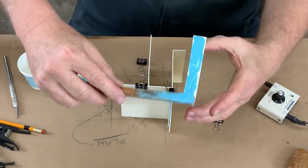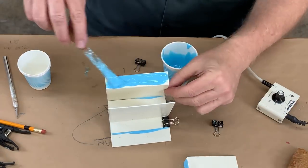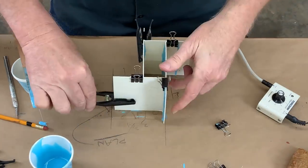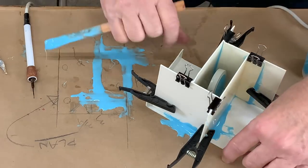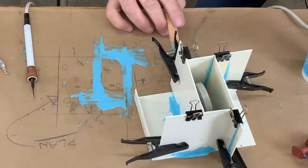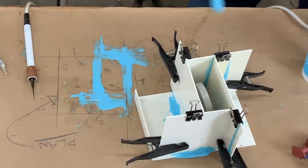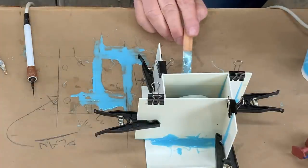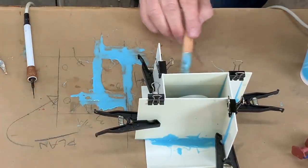Let's put this case together and we're going to glue it together with the same rubber that we cast it with, so everything will be nice and compatible. By using rubber like this as a sealant, you know the mold's going to come apart well, everything's going to be compatible, and you're not going to have any problems. And if you're careful at this stage, you're going to make a mold that can't leak.